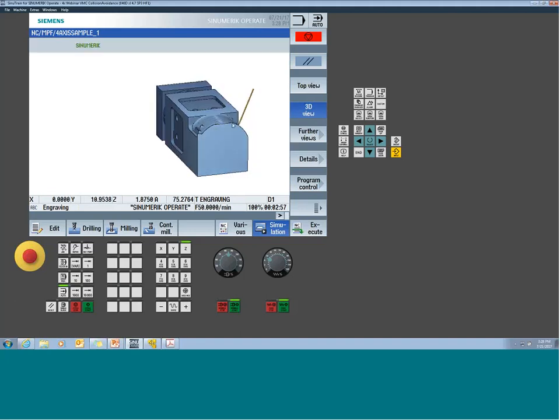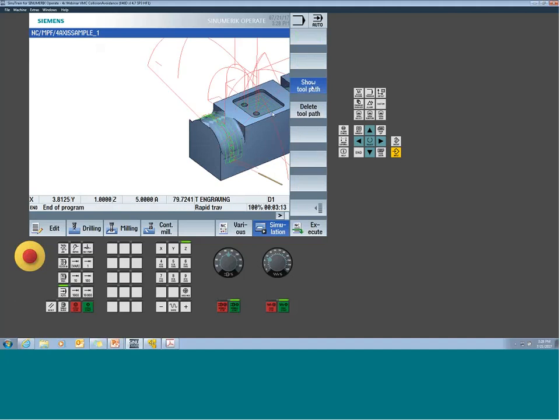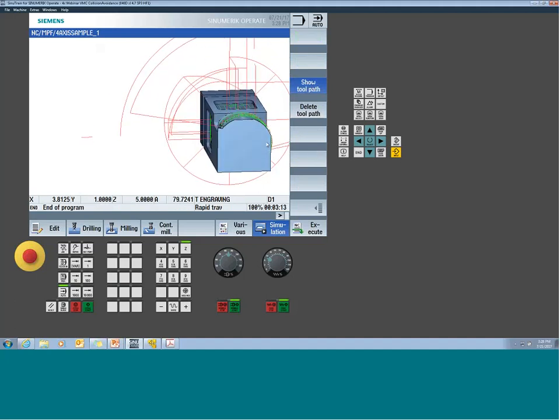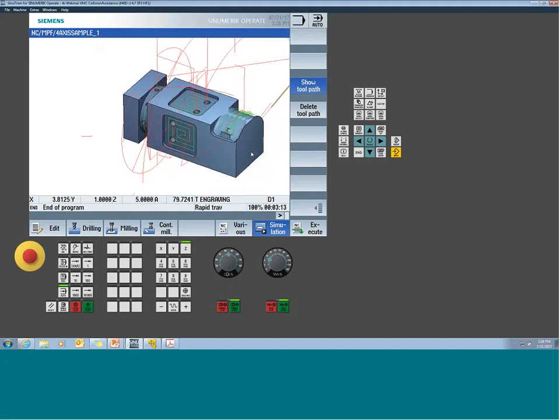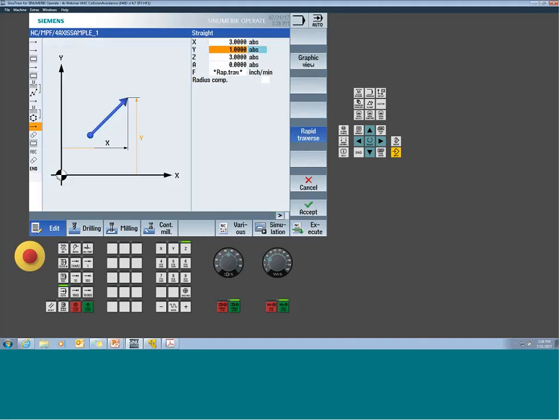Because again, it's using that pre-stage value of the axis we're going to be substituting with for its rotation command. And even my engraving is off. Bring up my show path, you can start to see everything. It's shifted now. That's why it's important to pay attention to where you stage the axis you're about to substitute with, because it will skew it. Okay, in our example, I'll just put mine back to 0.